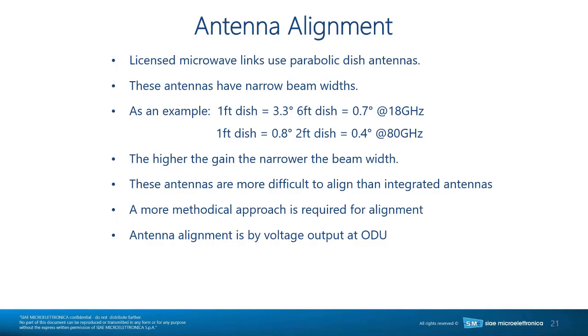The relationship is quite simple: the higher the gain, the narrower the beam width. The more antenna gain you get, the narrower the beam. So whenever you want more received or transmit gain from the antenna, you are narrowing the beam width, which explains why you get more power. The antenna is a passive device — you put a fixed input power into it, but keep it focused into a smaller area, so the power in that area is higher. More power, narrower beam — it's a very fixed relationship.